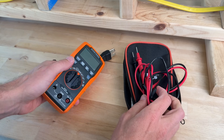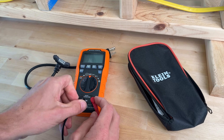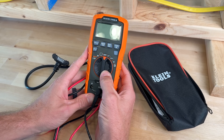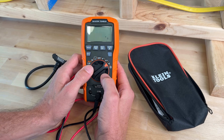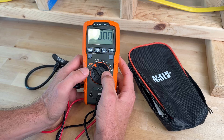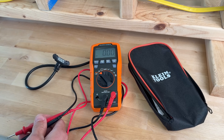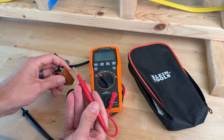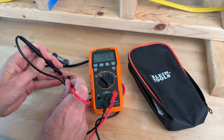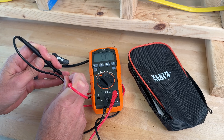You also have additional multimeter functionality built right into the same unit. You can swap out to standard test leads — red and black, positive and negative. This is going to be a lower-end multimeter; you're not going to have all the different capabilities, but we do have voltage AC, voltage DC, continuity check, and resistance check. In addition, over on the other side, we have a 9-volt battery tester and a 1.5-volt tester — so that'd be your double-A's, triple-A's, C's, and D's — where you can test the battery quickly to see if it's within the expected range. Match up your red lead to the positive side and black to the negative, and we can see it reads just over nine volts. If it's within 10% — so that would be 8.1 volts — you know you're still good.